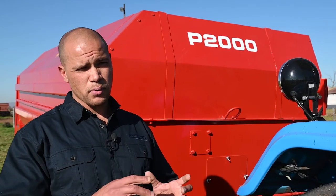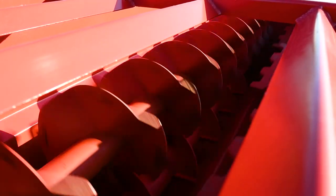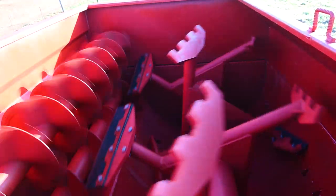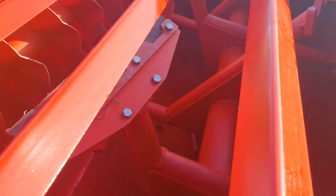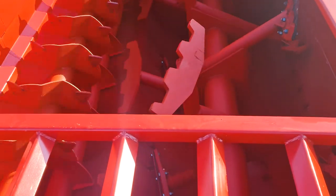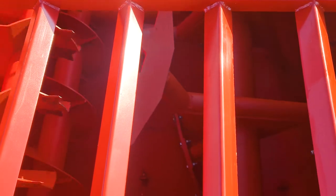The other big difference that we have is that on our top auger we've got about 115 serrated blades. These blades are there to cut your grass and your roughage, and because of the speed at which this auger turns you actually get a much better cut much faster. We've also got blades in the belly of the machine, so the paddle pushes the feed and roughage through these blades as well, which adds to the cutting efficiency of the feed mixer.